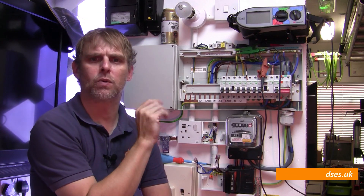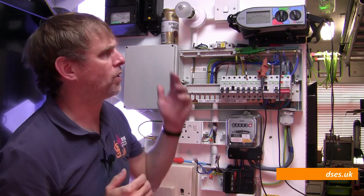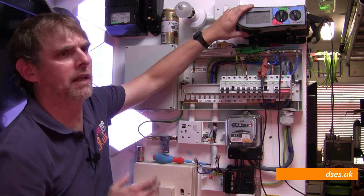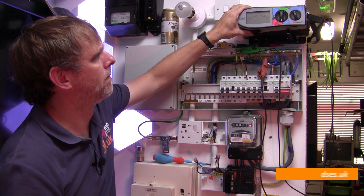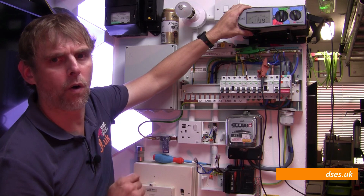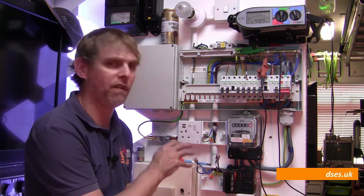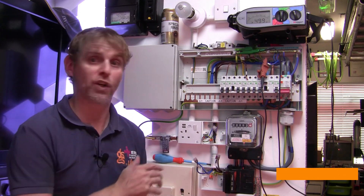For shits and giggles, let's repeat that procedure at 1000 volts. The Megger will give me an audible warning tone once I press the button and before it executes the test. But again it's just wiring here — there are no accessories, so there should be nothing that can get damaged even if we're passing 1000 volts through it. And there we are: an off-scale high of over 499 megaohms on this setting. So on this initial verification I know my cabling is sound. I can now walk away from the site for days or even weeks, leaving the Wago connectors in place so I can quickly repeat the dead test when I return.